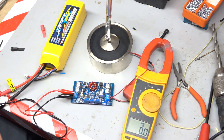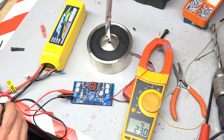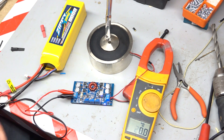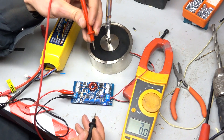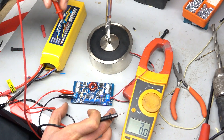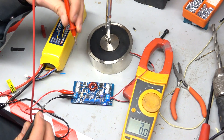Our battery, which is a 6-cell lithium polymer from Hobby King, is a bit too high of voltage — 23 volts — for some of the components, such as the pneumatic valves. So we're going to have to drop that down to 12 volts. To do that, we have a buck boost converter. These are available on Amazon, they're pretty cheap, and there's a link in the description.